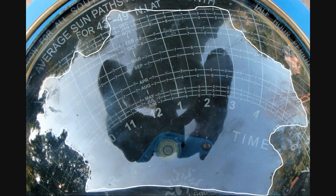Here's the photo I took. On the bottom of the chart are the hours of the day. That big tree to the east is blocking the Sun — here's the 9 o'clock line, so it's going to take until about 9 in the morning for the Sun to transition up into the sky where it's actually hitting my solar panel. There's a lot of shade being thrown on the panels from that big tree. You can also see shading from all the other large trees going from east to west around the horizon, which is what we want to measure to determine the impact on total solar getting through.